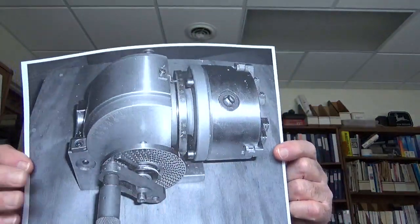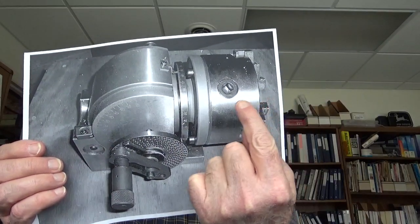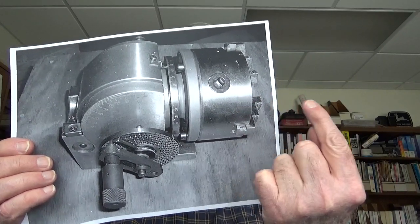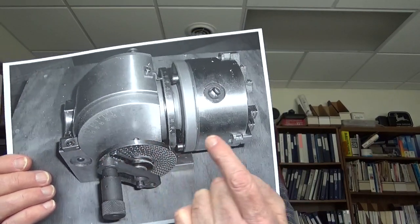The first thing I did was look at how some other folks have built gears, and I learned from watching videos of other expert machinists who make gears that the gold standard for doing that is a thing called a dividing head. It looks like this. It has a chuck on one end here that you can use to hold a mandrel or something that would hold your gear. And it has a crank down here, and there's a 40-to-1 worm drive between this crank and the chuck,